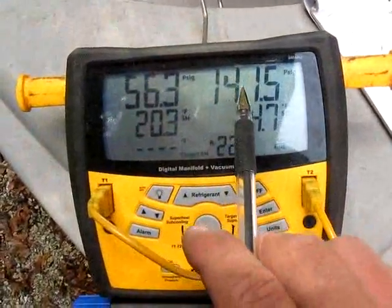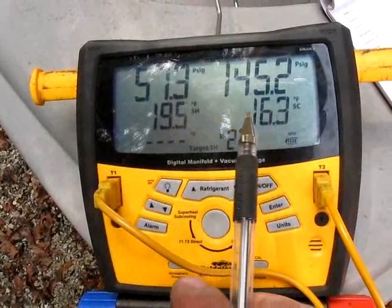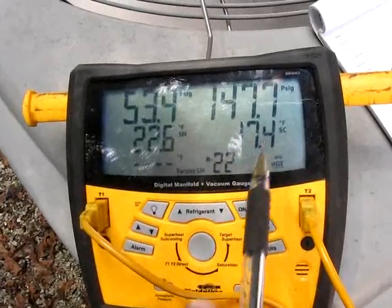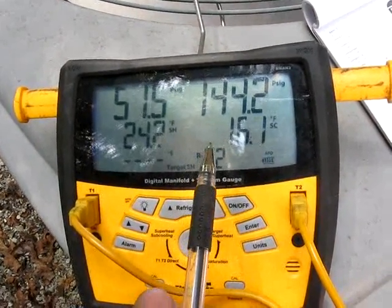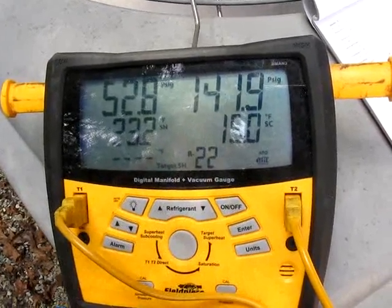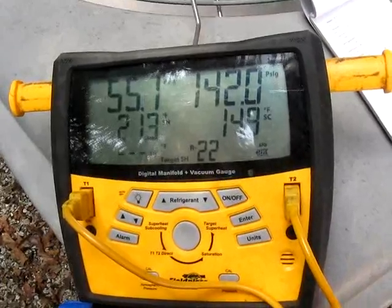High pressure is 141.6, low pressure 56.5. Superheat's coming down — it's in the high teens, a little higher than I'd like given the evaporator coil condition. Subcooling is definitely a little high — design subcooling is 10 and it's been anywhere from 14 to 17, so it's just a little overcharged. Originally someone had put a lot of refrigerant in it and I took two pounds out. Looks like we still need a little more out. It's a cool 67-degree day, so we're almost in an area where you can't even accurately check subcooling. What I'd like to do is address the charge when I change the evaporator — it really needs to be changed, so it's pointless to fully dial it in until we do that.